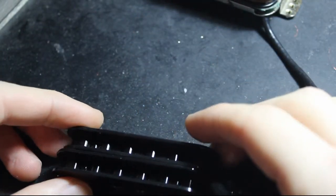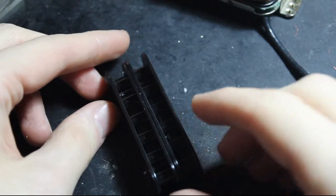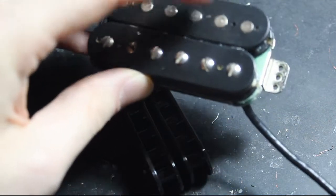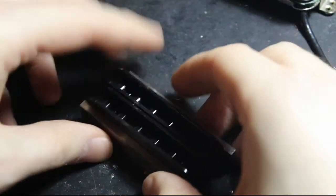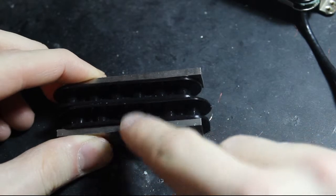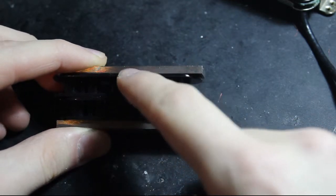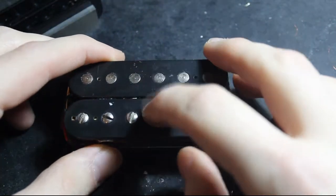Because it's clearer, hopefully it should be better for stuff that requires heavy gain and lots of distortion. For it to be a humbucker, we need different polarities at the string above it — usually that's done with the poles in the middle, with south here and north here. But there's no reason why we can't have magnets on either side, charging the string. With north on one side and south on the other, north will charge that section into a southern charge, and the other side will charge it the opposite. We'll have a little dead zone in the middle, but no more than a standard humbucker already has.